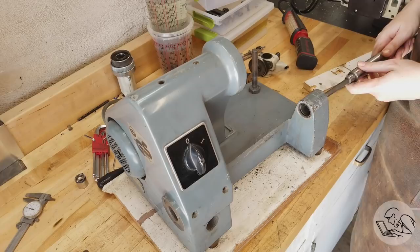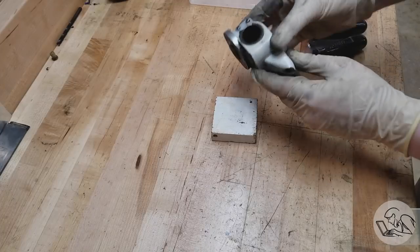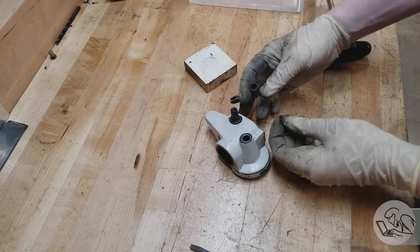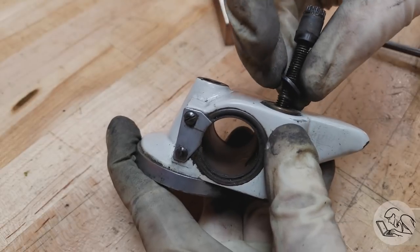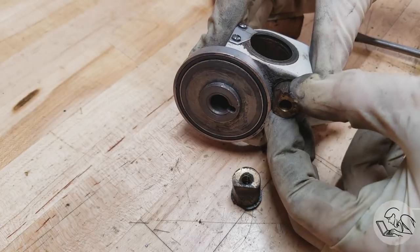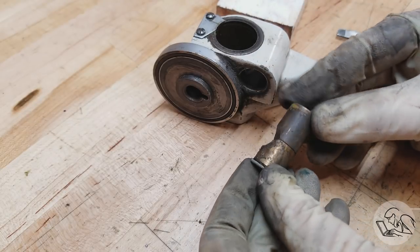That bar might need a little cleaning but it looks to be in good shape. Now we've got to take apart the base of the workhead — this was the last piece we couldn't get to. The handle that tightens it onto the bar is incredibly tight, but some tapping on the screwdriver worked to loosen it. The locking mechanism is actually pretty interesting — it's a two-part brass or bronze bushing. Both pieces have a curve cut out that fits around the bar, so the locking handle just tightens the two halves together, locking it against the bar. And being bronze, they're soft, so they won't mar up the precision bar.